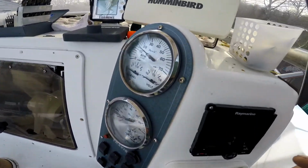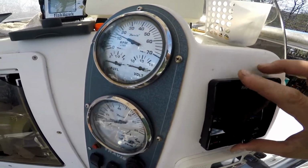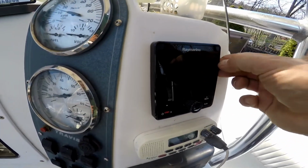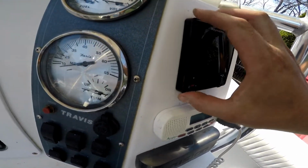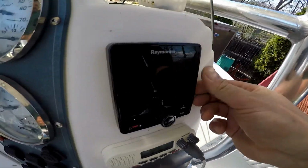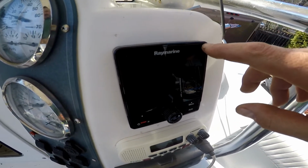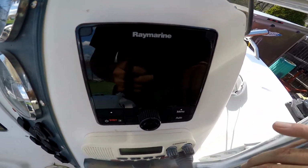And simply, you have this cover, which goes right over that unit and clips in. Usually the package comes with another cover. It's got a gray color on it, so it's up to you whatever you want to choose. It looks something like this. When you screw it in, I use a regular hand screwdriver so you don't break the glass. Sometimes the screw just slips and hits the glass right in the corner and you crack the screen. So make sure you don't do that.